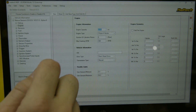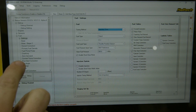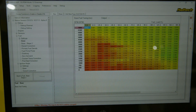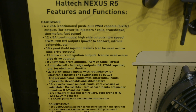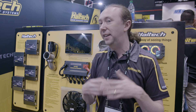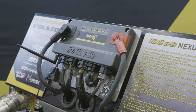The ECU component of the R5 is based on the Elite ECU, so all the functions you're used to will work the same, and you can import maps from the Elite into this. The reason we needed to do something different from the Elite ECUs is that we wanted a lot more IO. The 2500 is limited to 8 injector outputs, so if you want 16 or 18 injector outputs you need other boxes to do it, which is inconvenient and not a clean solution. That's one reason we had to step it up and go a bit next level.